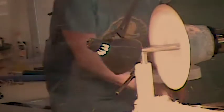No scraping inside. When the wood's that thin, it doesn't like it. But the good news is it's far easier to get a nice bevel-riding cut because the shape fits the tool so well. You can do good cuts inside way easier than you can on the outside because of the cylinder shape. Looking good now. Yeah, it's all good.